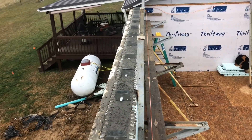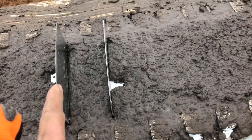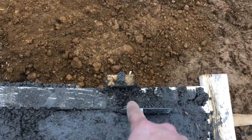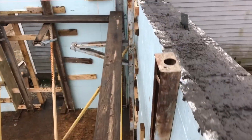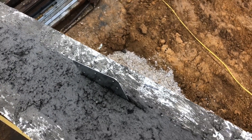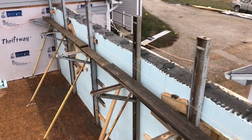Here's what she looks like all done. The wall is good and straight. We got all our insert plates in there — the truss will come back and sit right in there and will get what we call a tar paper diaper to protect it, plus hanger nails on each side. There's that little half-moon — a piece of concrete for the truss to sit on. The gable all turned out pretty darn good. We had a little extra time, so we put the window well in too — that turned out good. Josh's luck did run out though: we were about three-quarters of a yard of concrete short, which isn't too bad. The first two pours we were dead on. The batch plant had a truck left over so it didn't hold us up too long.